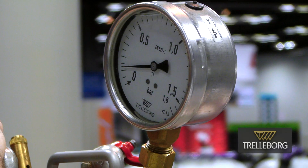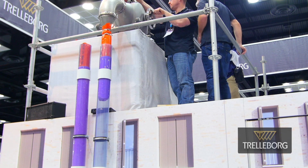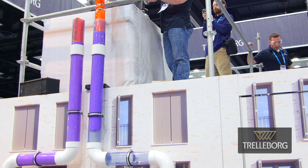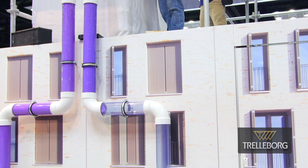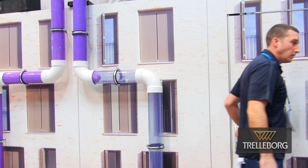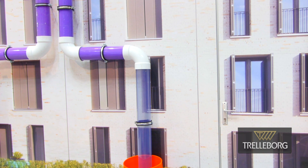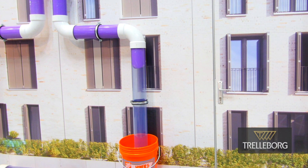Now because this liner is really thin and easy to move, you'll see inversion pressure doesn't have to be that high. John probably will not increase to more than 7 psi to get this liner. You'll see here he's going to get to that corner and he'll jump a little bit, but he has control there and he can move it through — no problem. That was an easy one.